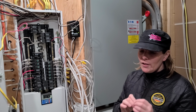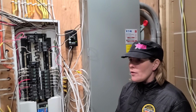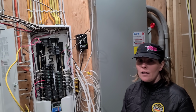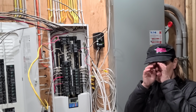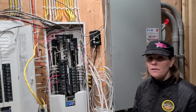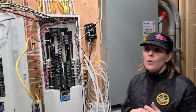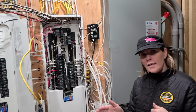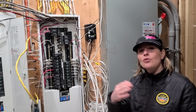So right now we have a temporary heat tape in the line, and it's working good. But there's a lot of things that go along with that kind of thing. The biggest thing, after a year, it starts to really grow. What's the stuff that breaks everything? Bacteria, and bacteria keeps it from freezing. But also, I've read a lot, when first-year people have the same system, if you go on a holiday, they say to put antifreeze in there, otherwise it'll freeze up because you're not using it on a continuous basis.